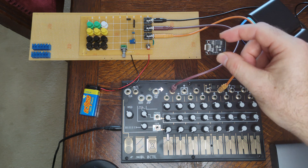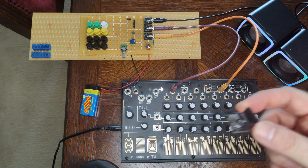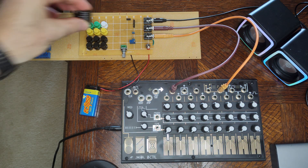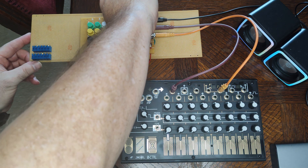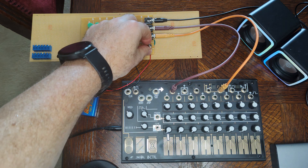I thought surely I wouldn't be able to do anything on that, so I gave it a go. It's powered by a 9-volt battery. I'm using the No-Control as a CV — it's got 1 volt per octave CV in, and analogue gate in. It's actually pulse width modulated out, so it works well through speakers.